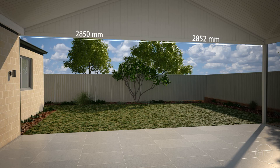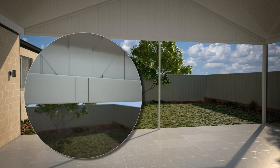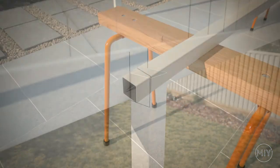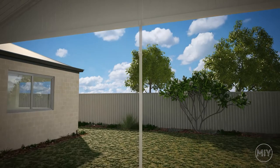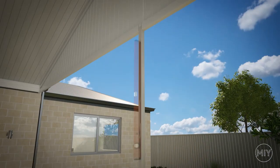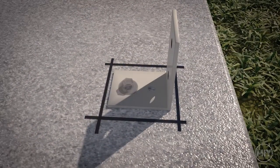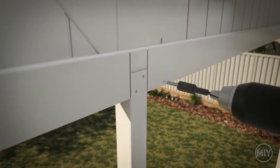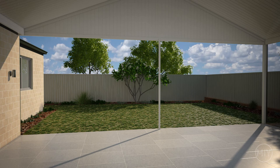If you have ordered a post, mark out the sizes of the blinds from your job card onto the patio beam — this will show you where the post needs to be attached. Measure the height from the ground to underneath the patio beam and allow an extra 50mm to connect the top of the post to the patio beam as demonstrated in this video. Notch out the post with a thin angle grinding disc to suit your application. Please note, this is one of many ways to install a post — refer to our website for more photos and applications. Place the notched support post in position and check it is level from both sides. Mark out the bottom by drawing a line around four sides of the post, fix the internal bracket onto the floor inside the four lines, place the post over the bracket, double check your levels and fix the post to the bracket. Then attach the top of the post to the main beam, check your levels one more time and fix. You can now install the back angle, channels and brackets as per a standard install.